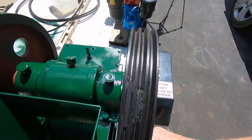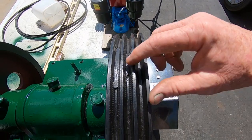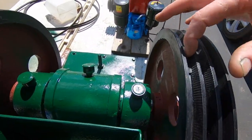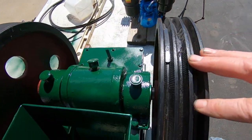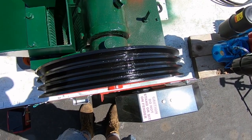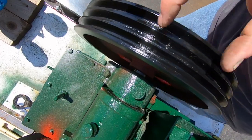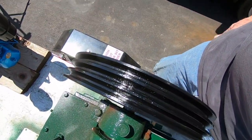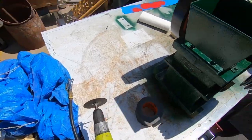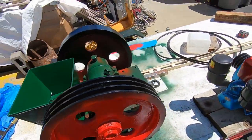Okay folks, the second try on this looks pretty good. You can see the bottom of the belt was nice and flat in there. The side pieces that I really wanted filled in that had some jagged edges on them are perfect now. I'll probably use a Dremel to clean out the bottom. You can't really even see the repair by eye, let alone with the camera. JB Weld did a good job. I shaped it a little bit and painted it - looks okay. Belt fits in there perfect, I think it'll be good. Another fix!